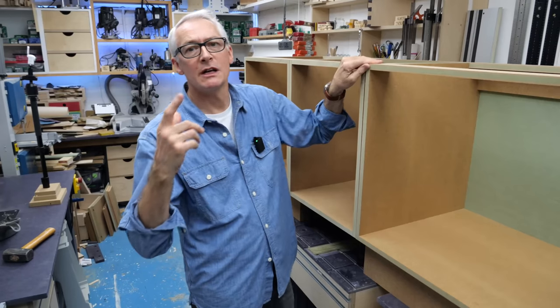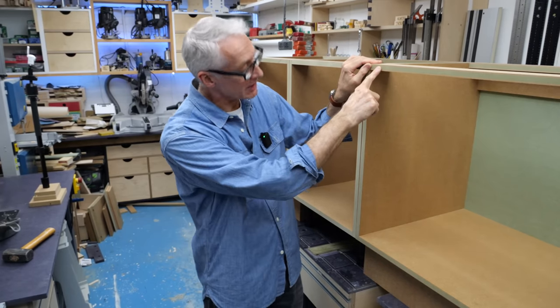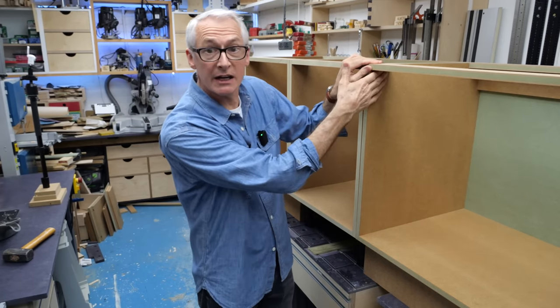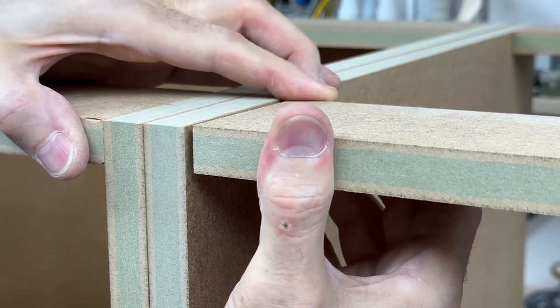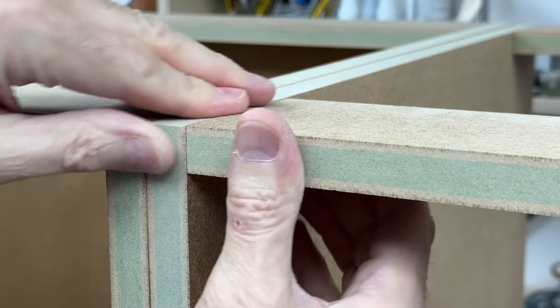While we're at it, yes, most commercial cabinets have the top stretchers and the base set within the sides for all the same reasons as they are on wall cabinets: strength, aesthetics and convenience of manufacture.